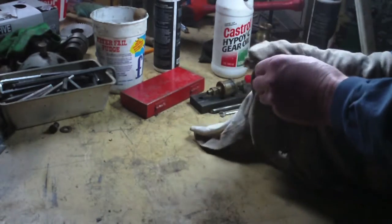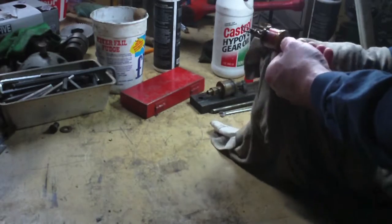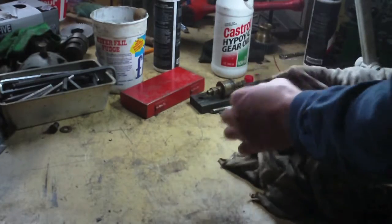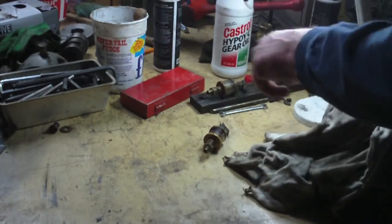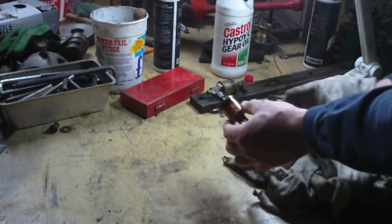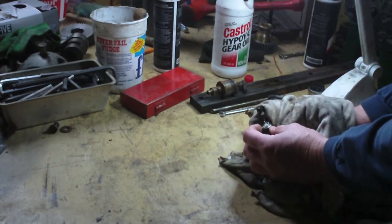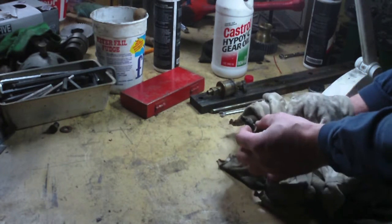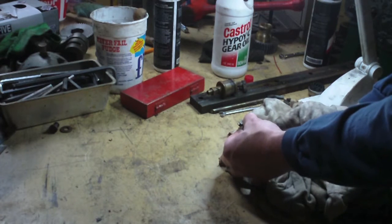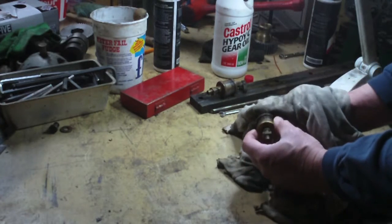So these little oilers were actually on the bearings for the headstock, and these thread in, but they were just dropped in loose. So I think that headstock assembly had little oil caps like what's on the Vernon and other cone head lathes, and the guy just took those out and got these oilers. And these oilers are actually kind of neat. They've got a little trap door on the top here to fill the oil. They've got this valve thing here where you can adjust this knurled knob, and then I think when you turn this up, it actually opens the flow and lets the oil flow out.